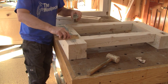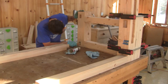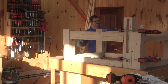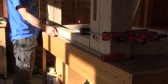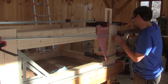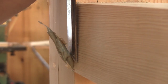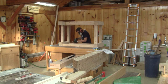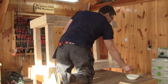So now I can disassemble everything again and glue the fixed part of the vise to the actual workbench leg. Next, I glue the stretchers and clamp everything. This requires several long clamps, but I manage it. The next morning the glue is dry and I can clean the excess glue, then sand what I didn't sand before. When I'm done, I clean the base just before brushing its first coat of finish.